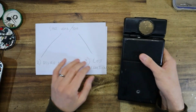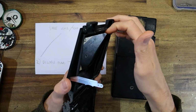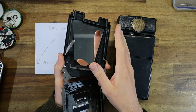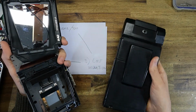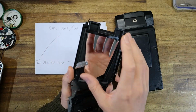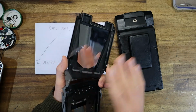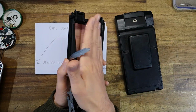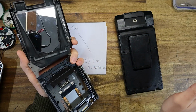And another very common issue is the mirrors. So inside an SX-70 chassis, there's a mirror, and that mirror is held in place from the factory with 3 big blobs of silicon. And in later model cameras, typically starting at the SX-70 Sonar series, but definitely continuing into the SLR-680 series, that mirror is always loose because the type of silicon they used or the type of coating that was on the mirror basically separates over time. The mirror comes loose, it drops inside the camera where it tends to smash and shatter, destroying everything.